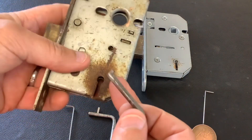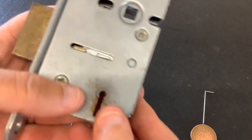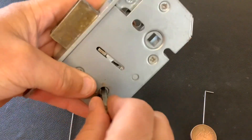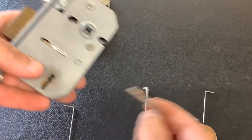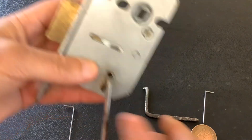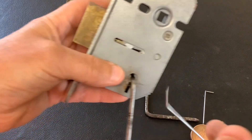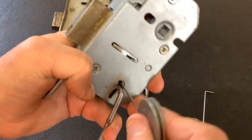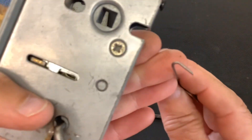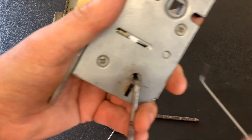If you put a curtain-type tension tool in a lock without a curtain, it'll just turn around and won't catch the bolt. For a lock with a curtain, you can use a tension tool without the upright as long as it's got a bit of a nib so it will still tension the lock — but you can also still use the upright type. If you try to put a straight wire in because it hasn't got that little kink, it won't bend around the curtain and you won't get it under the levers. For curtain locks, the wire needs that little tiny bend — it goes around the top of the curtain so you can lift the levers with it.